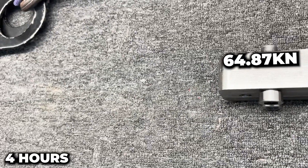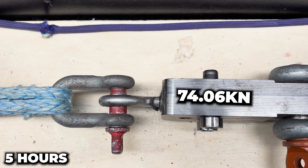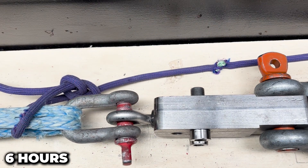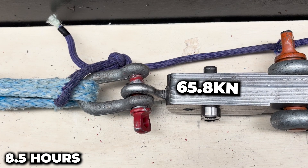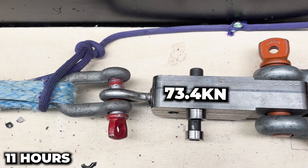At five hours, at 74.06 kilonewtons, the bolt finally broke, giving us full strength out of the epoxy. This is where it gets interesting — you have a range in which the bolt will break and a range in which the epoxy will hold, and they overlap. At six hours it pulled out at 81.4 kilonewtons, but then at 8.5 hours it pulled out at 65, and at 9.5 hours and 11 hours the bolt broke. Basically you float in that 60–80 kilonewton range with the epoxy and bolt in a tug of war.